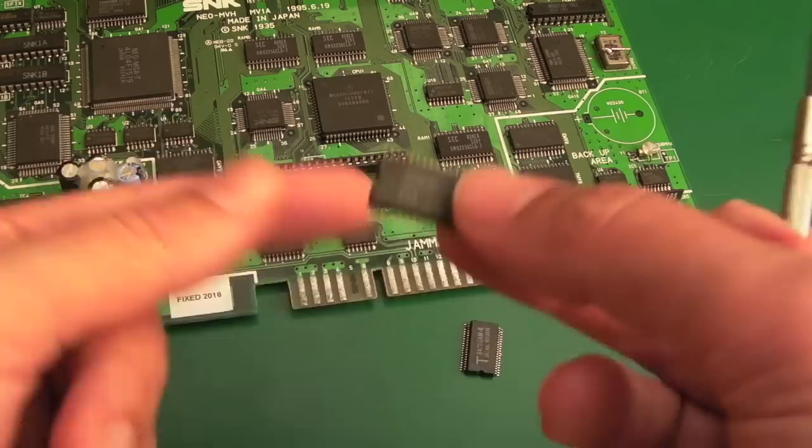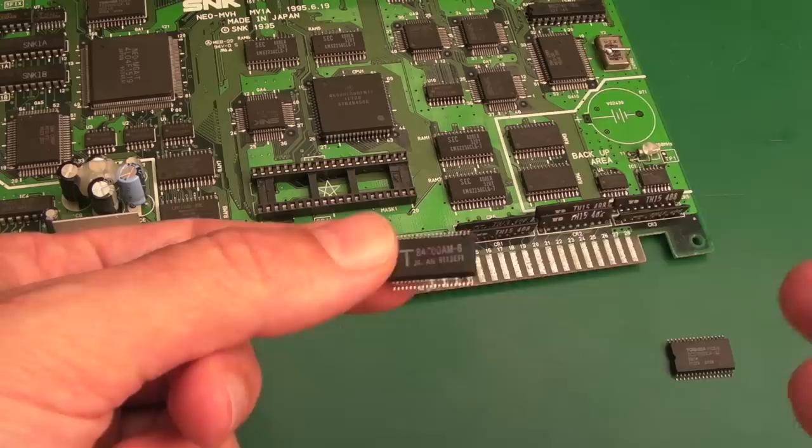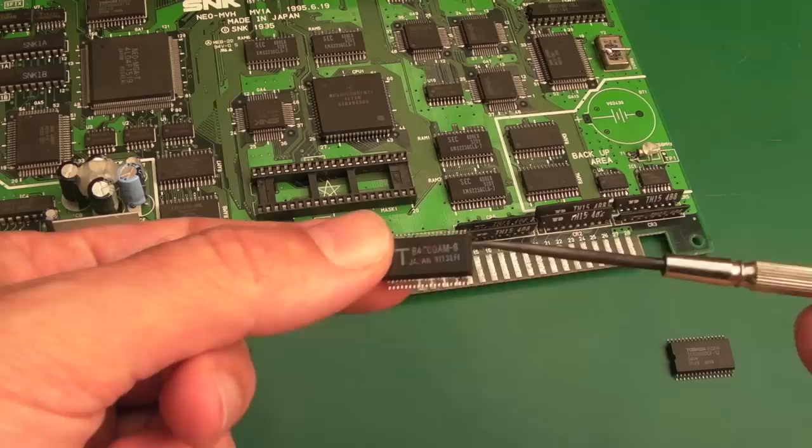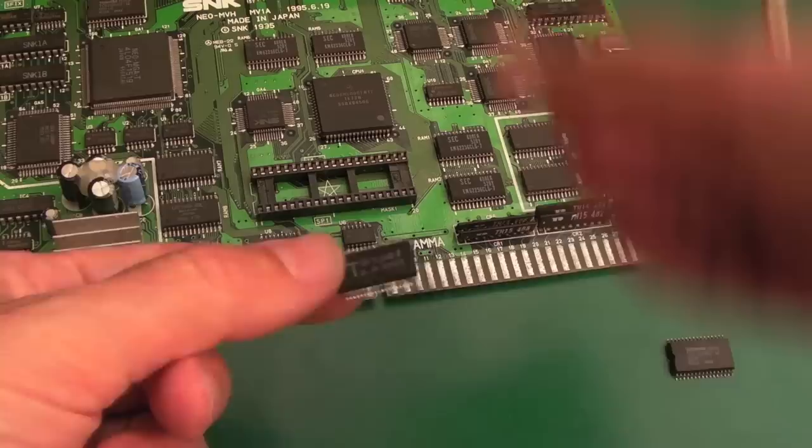And the other interesting thing is, you could almost argue that this has been a Game Gear repair video, really, because that fault with that Game Gear, I'm pretty sure it was just the Z80. I'd suspected it was one of the ASICs. It was one of the ones where I'd recapped it, cleaned it all up, taken some measurements and stuff, couldn't get anything other than just a black screen. It was doing nothing. And I suspect it was the Z80, and we discovered that by putting that on here and then getting a different error back. So yeah, consider that Game Gear probably fixed, if I could find a source of these Z80s.